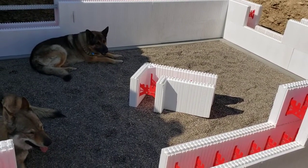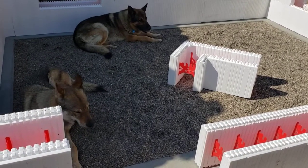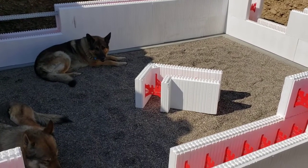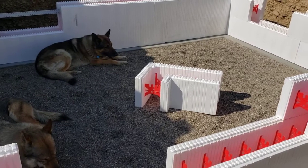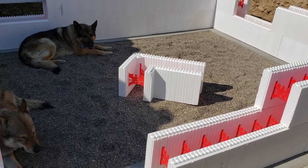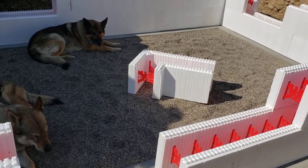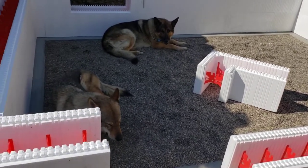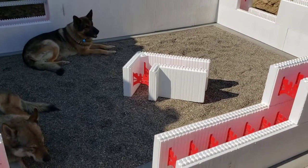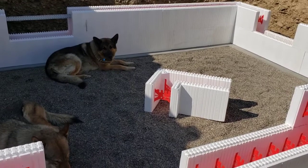I've got footings on the ground — about 20 inches wide, 10 to 11 inches deep. The inside has pea gravel under an underlayment, and under that underlayment fiber is hardware cloth — a metal, real tight mesh. That's to allow everything to breathe in these root cellars. You don't want any condensation, or animals, gophers, or moles coming up from underneath. So we've got it sealed pretty well, but it is breathable — if we get moisture it'll drain on down out.